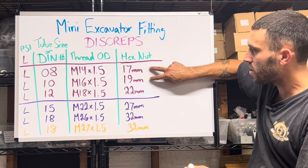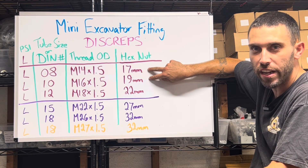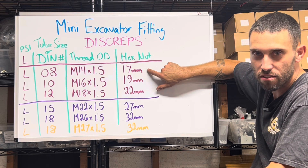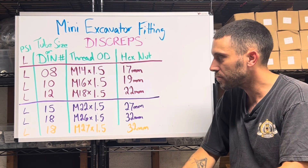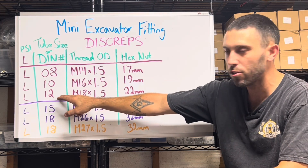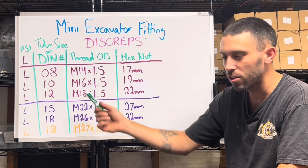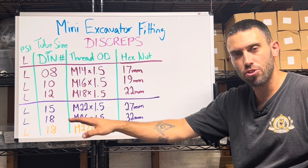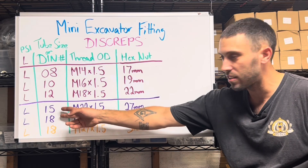These two sizes are really what exist on your machine. If you have a QH12, FF12, or H15, you've got an L10 for your aux hydraulics and everything else is L8 — your swivel motor, cylinders, wheel drive motors, everything is L8 series. Once we get past the cylinder supply side, L12s are like your half-inch lines on two-ton, three-ton machines. Getting down to the bottom, we're talking suction and discharge coming off the hydraulic tank, the pump, going to your DCV body — that's all down here.